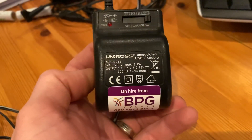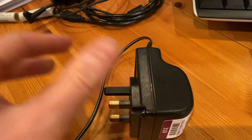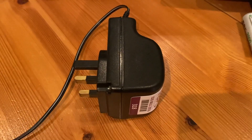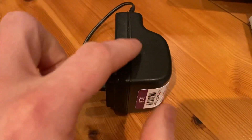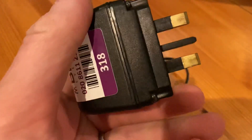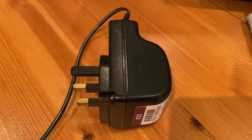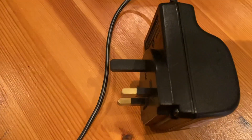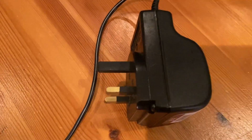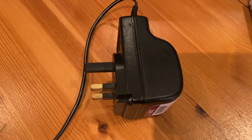We're going to take this one in particular. You can see that it's got the Class 2 logo with the two squares. Before you do anything else you would do a full visual inspection. On these particular adapters you'll find they often come in two pieces and they're either snap shut or glued together. On some older adapters the glue has perished, and if you give them a little wiggle you'll find the two components will come apart — so that's an instant fail. The other common thing to look out for is the plastic earth pin, which could become snapped or bent.